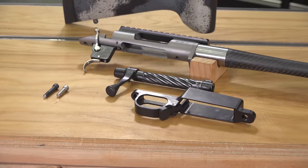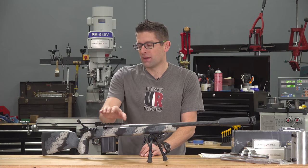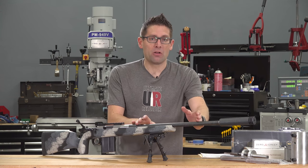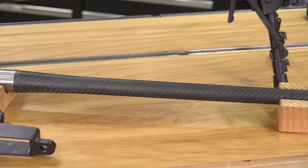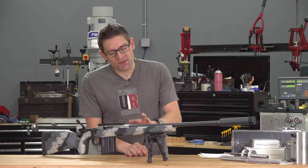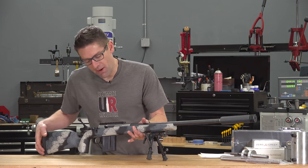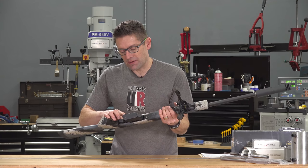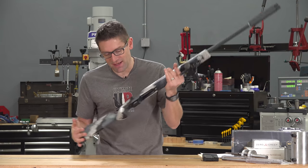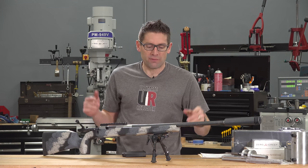The build is built on a Pierce Engineering Remington 700 semi-cloned titanium action — bare titanium with a pinned titanium recoil lug, chromoly bolt, external bolt release, and a 20 MOA pinned-on scope rail. The barrel is a Benchmark stainless 1-8 twist, 24-inch finished length, 5-groove barrel blank with a Hell's Canyon custom carbon wrap. We've got a Benchmark custom carbon stock, Red Snake Tactical bottom metal with bolt release, and an Accurate Mag 10-round detachable box magazine. I like to have magazines loaded and ready so the rifle is in a known safe condition — pop it in, chamber a round, ready to roll if you come up on something unexpectedly.